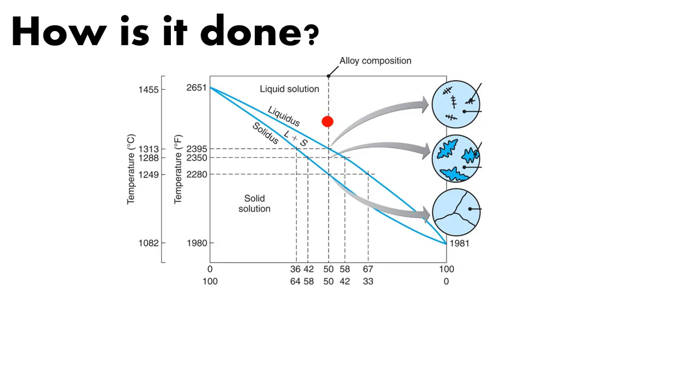What we have here is a phase diagram. At the top is the liquid state — all this area is liquid. Down at the bottom you have the solid state. On the left is the temperature in Fahrenheit and Celsius. Down at the bottom is the composition of the two metals making up the alloy. In the middle between the liquid state and the solid state is what's known as the mushy zone. This line is known as the liquidus — meaning we've crossed into full liquid. This line here is the solidus — meaning we've crossed into solid. As it crosses the liquidus you're getting the start of the dendrites, and going into the mushy zone the dendrites grow, then as you cross the solidus the dendrites have fully formed into crystals.